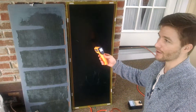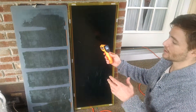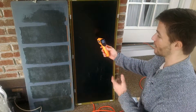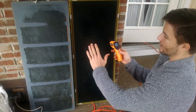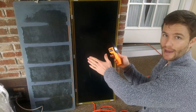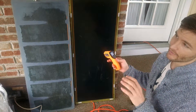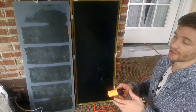It doesn't matter where your thermostat is, it doesn't matter if it's some fancy carbon system that they're claiming. All emitters will get to 9.4 microns, but it'll already blow past that point and start to fall in micron range after 5 minutes. We're going to hover somewhere around 145. If you have your hand even out this far, you can feel some warmth, but it's generally very weak compared to a ceramic emitter — that's why you need so many of these to cover the walls. They're very low wattage, very inefficient; you have a conversion of maybe 45 to maybe 60 percent of electricity that actually converts to infrared.